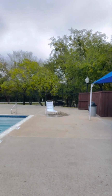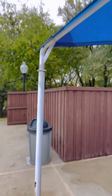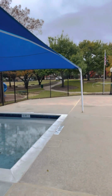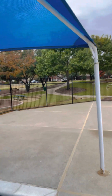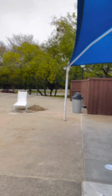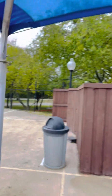But like residential remodels, always go in the alley or the front. If a customer does have a manhole, like a pipe that comes up that goes directly to city sewer, we will always look for one of those first, because that's what the city likes. And a lot of times customers don't have them, so we have to find a storm drain in the neighborhood to drain to. A lot of times if I can, I'll go all the way to the storm drain and go directly in, so there's no flow of water on the streets. Sometimes I have to go down the street.